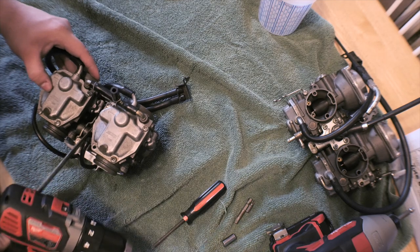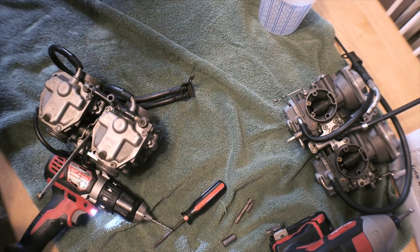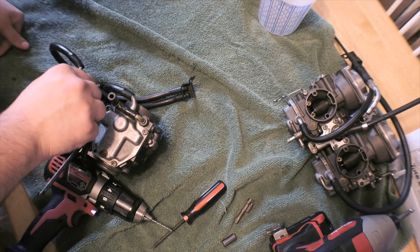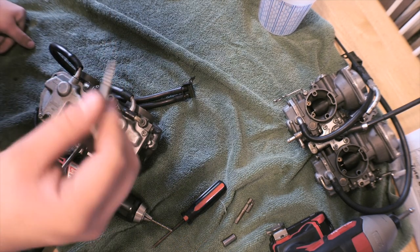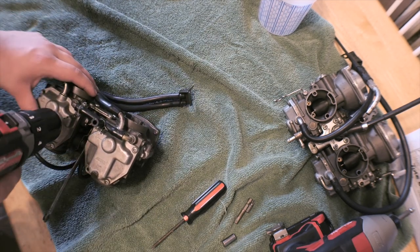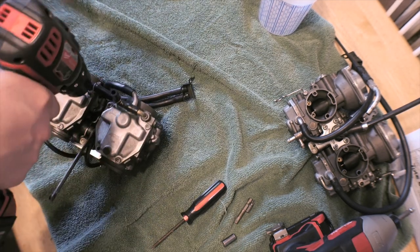After a little while, we're going to check this real quick and see if this will fit and if it still spins. Now if it still spins in there — which is the spiral bit — you're going to want to drill a little bit deeper. It kind of works on a wedging action, where after a little while it will wedge itself.